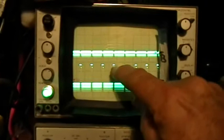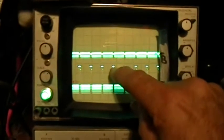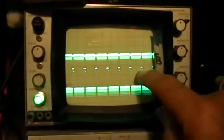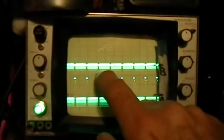So there, my function generator is actually turned up to its maximum amplitude right now. And yet we're still topping off at about 7 or 8 volts. It's about 8.5 volts, I guess, on the gate drive trace, because I've only got 4 batteries in there. If I had 6 batteries in there, this would be going up to about 12 volts on the gate drive trace with full power on the function generator. But as you can see, there's no current indicated in between those nice oscillations there.